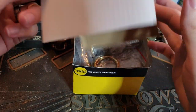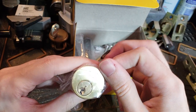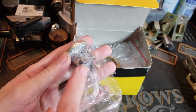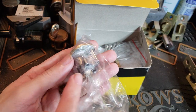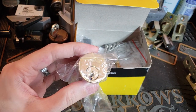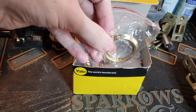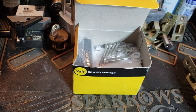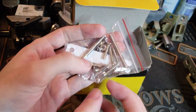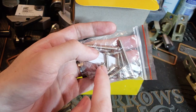So we open the box and pull out this little sheet of cardboard. First we have the cylinder that's included with it, which seems to be fairly standard for Yale's current Rimlocks. The cylinder body looks like it's cast from probably Zamac, but the actual plug seems to be milled brass, which is not the worst in the world. Stamped brass coloring, and a bag with a mix of wood screws, fairly short ones, and some different size machine screws.